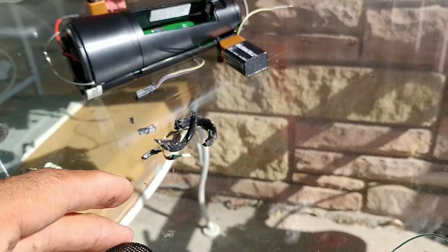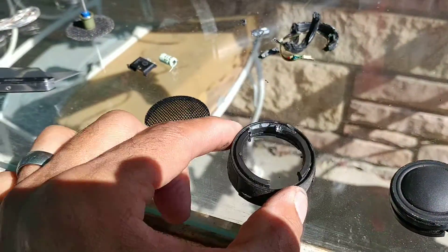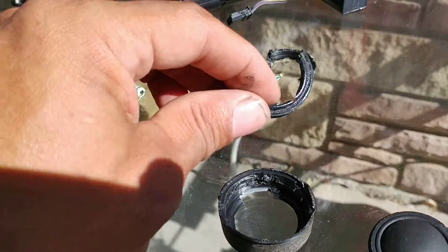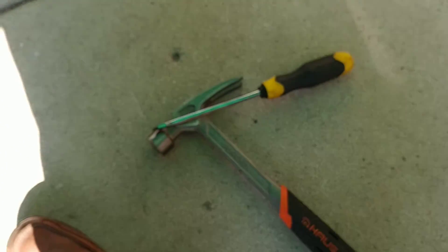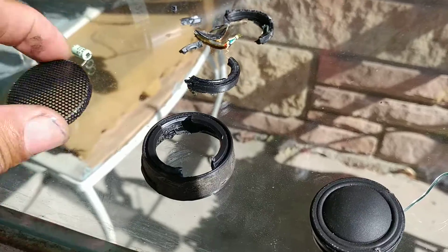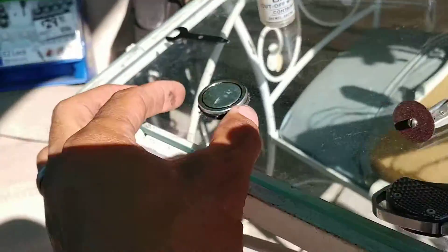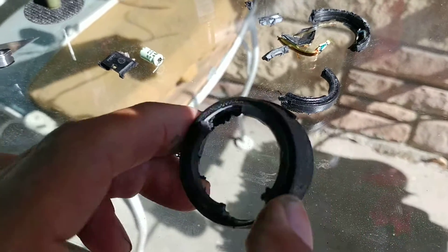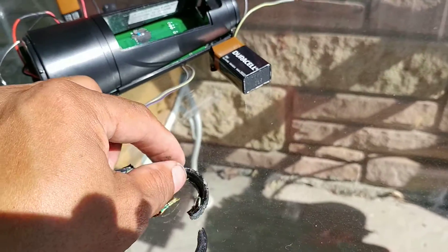Here's the original module, disassembled. Disassembling this original module is the tricky part because it has an upper lip, and underneath it is the actual retainer clip for the speaker. This is the speaker body — the remnants of it — and this is the magnet. What I used was a hammer and a flathead screwdriver. I flipped over the unit, popped this off, hammered directly down and that popped out the magnet. Once the magnet was out, I hammered the upper retainer clip on both sides, being careful not to deform the bottom, and that allowed me to gain access to the retainer clip and the remnants of the old speaker.